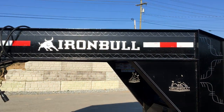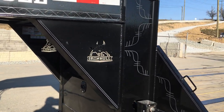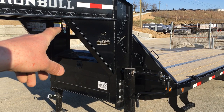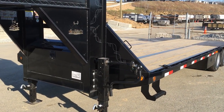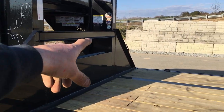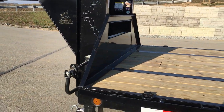The unit does have pinstriping on it, and it's also got their logo laser cut into the neck gusset. You'll see here they do a neck gusset going from the vertical to the horizontal and then from the vertical to the side rail — that gives a lot of strength. Some of your cheaper manufacturers tend to just take a piece of channel and put one or two pieces on the back of the neck, but they take the time to put the neck gussets on, which is nice.